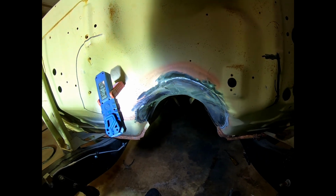I still have to finish burning them in, but my welder is flux core and it will probably smoke right through that. It did on the 66. I tried to weld rocker panels in on it and it took me probably 2 weeks off and on to get them to where they were presentable and right. I don't want to go through that with this car, so I guess now I have to price the gas to convert it and the different wire and try and get it going. Worst case scenario, my buddy Jason, a week from today or tomorrow, will be out to do the fenders, and I'll see about maybe trying to borrow his welder for a little while to do this, because I have other patches I have to fix.